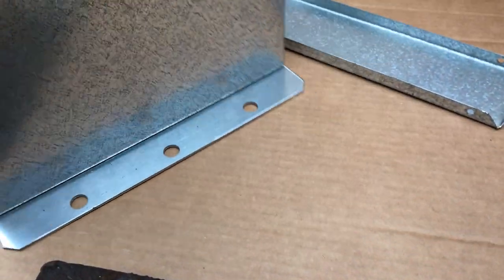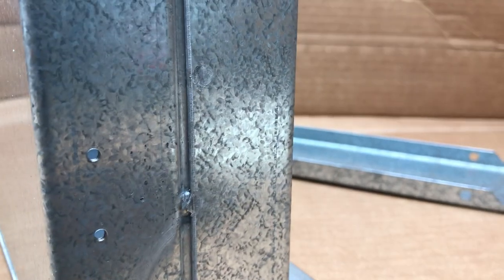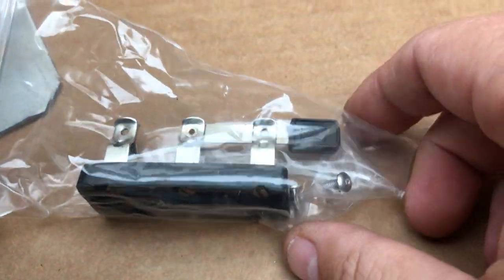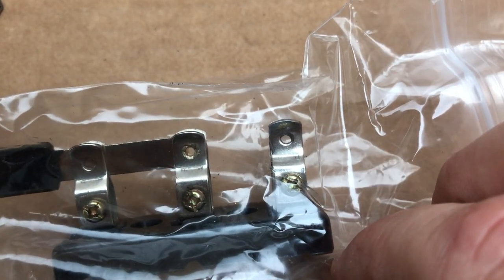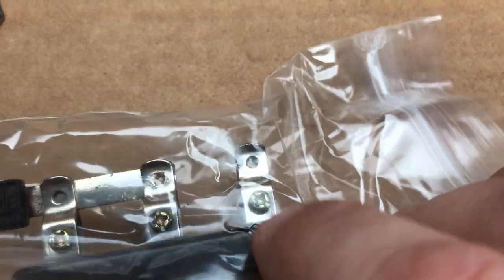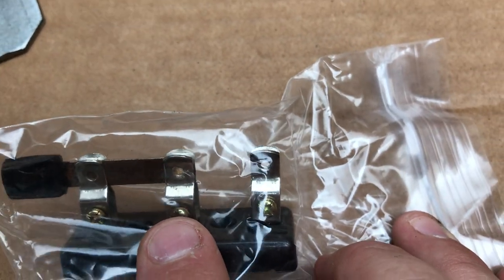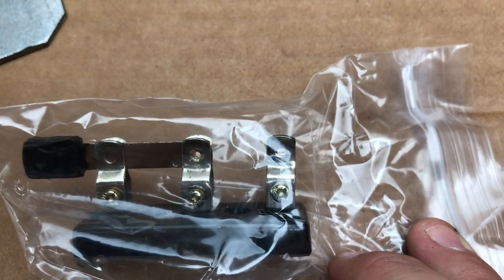Of note, as you can see, the box is already pre-drilled for the mounting of this knife switch. The knife switch is a two-way switch, and it does have terminals on each point. One end for your battery, the opposite for your magneto, and then your center position to go to the coil box.